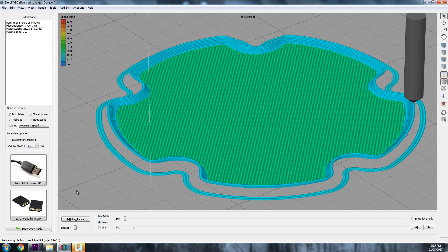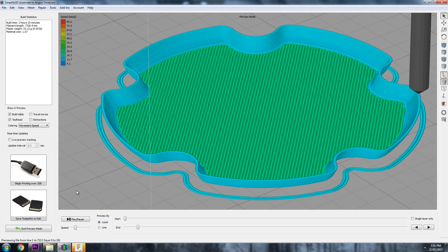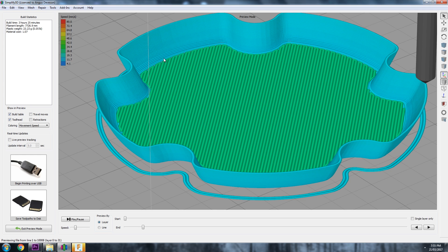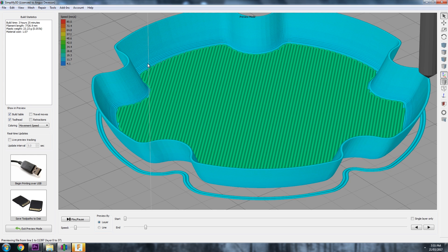In vase mode it's very thin, which means at the fillet area there might be a slight gap in some layers — it only leaked out the bottom, not the sides. So in this video I'm going to try a few changes and see if I can make it watertight. Unfortunately I can't test the original bottle again because someone broke it.